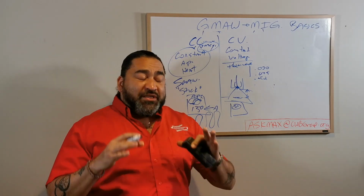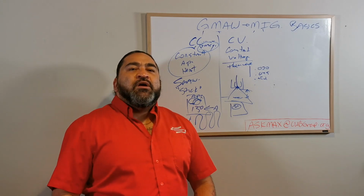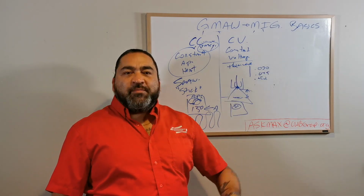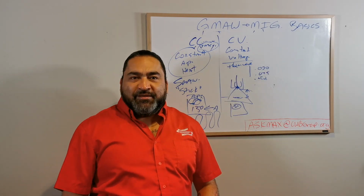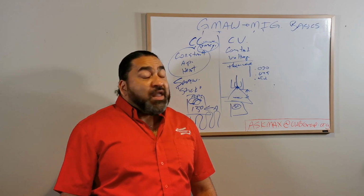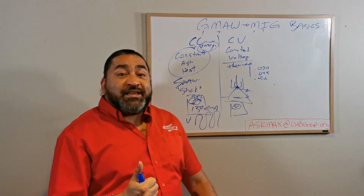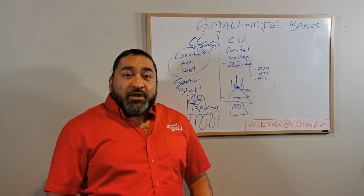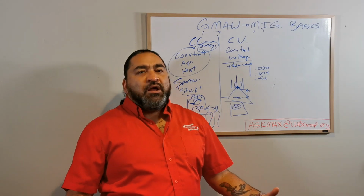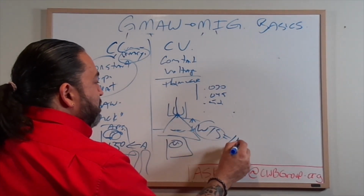And the number one thing that everyone does wrong, well, I shouldn't say everyone, but the dippity-doo heads out there that think they know what they're talking about, is that they tell you, hey, you're on a GMAW setup, go turn up the heat. And if I want to turn up the heat, what am I going to turn up? Not the voltage, okay? Turning up the voltage is not turning up the heat. It's increasing your gap, okay? Now, there is a ratio. I increase the gap, I'm going to have more wire. But really, in this world, wire speed equals heat.